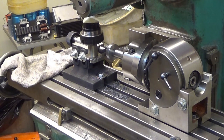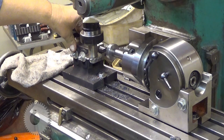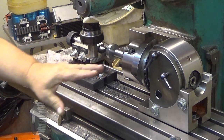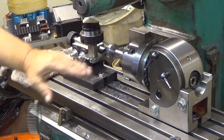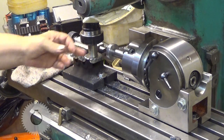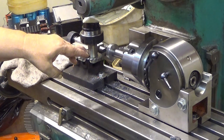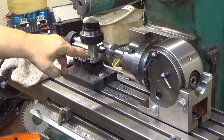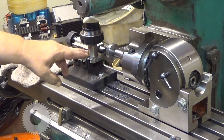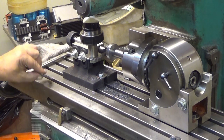So now, a small trivia for you. What's wrong with this? Well, first of all, the center height is suitable. I get the cut depth by touching this, yeah, all right. And the cutter is in place as it was in the earlier one. Did you guess? Well, it's here under. We need to change the cutter.